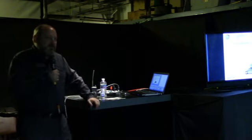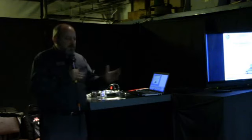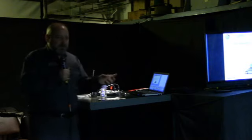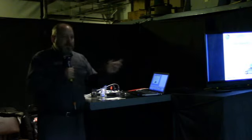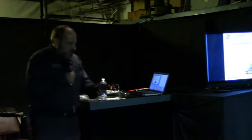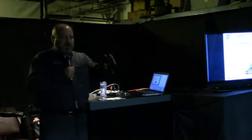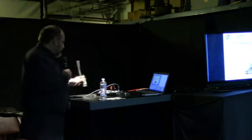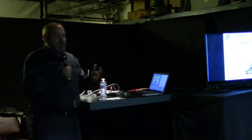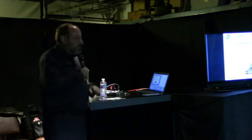You also get simultaneous voice and data, so we'll talk about how the signal is split up, but along with the voice, you get 1200 baud of data. And in that, it sends the routing information for the signal. If you have a GPS hooked to your radio, or in this case, the 51 has the GPS built in, it'll actually send my GPS location as part of the data stream. And I can actually send really any other random data I want. And there's some options that use that, but there's a really great program called DRATS that takes advantage of that, I'll mention as well.